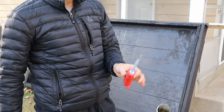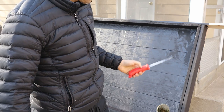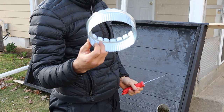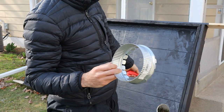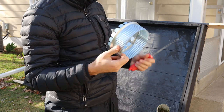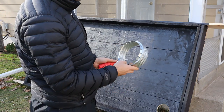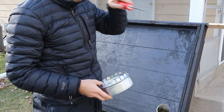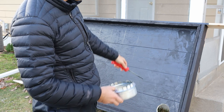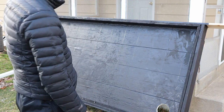This is a drywall knife for cutting drywall. I took the little piece of starter duct, placed it where I wanted it, traced around the outside with a pencil, and then used the knife to cut it out — just stuck it right in with the edge since it's sharp. So you end up with a hole there and a hole there.